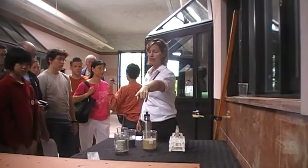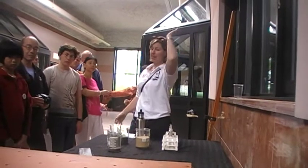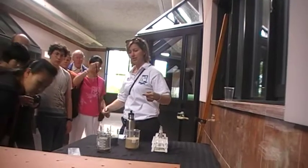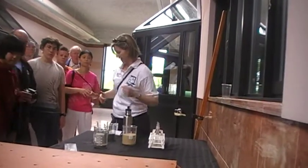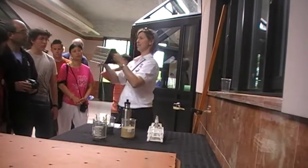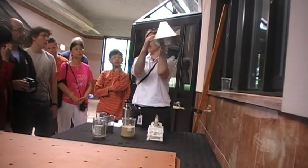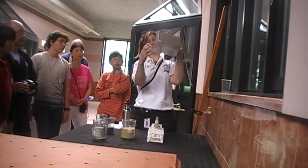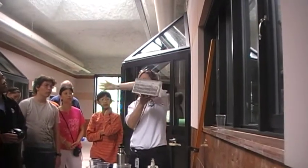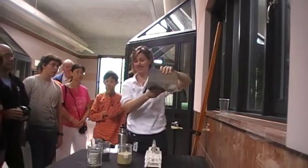And then these are our current ones, these metal ones. So we're changing out our filters for this improved one, and we don't even need gravel anymore because the sand won't go through those holes on the side. So the part here, hold on, let me just hold this up. So what happens is the water comes down through all that media and then through these little holes, and then it goes in through this channel, and this channel brings the water to the clear well. So that's how the water gets out of the filter on the bottom.